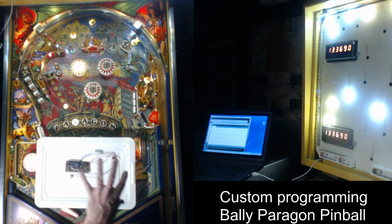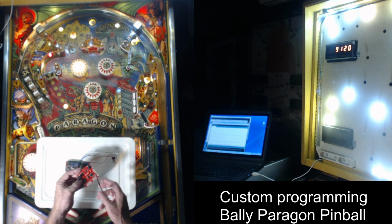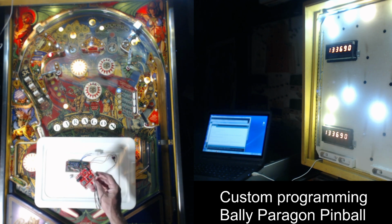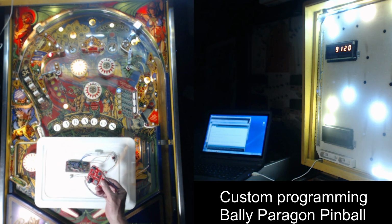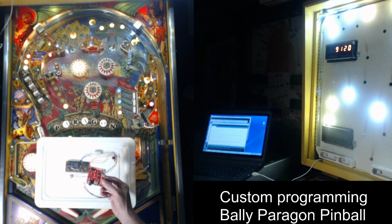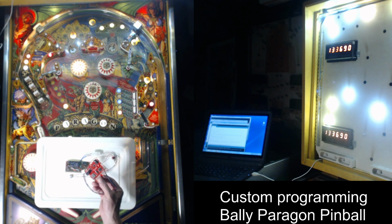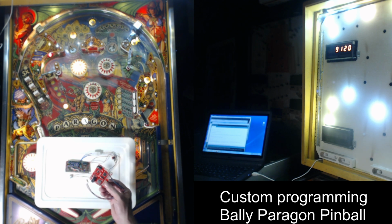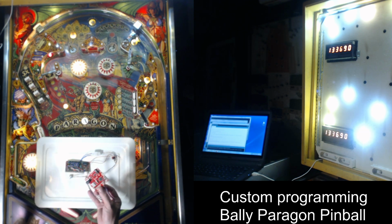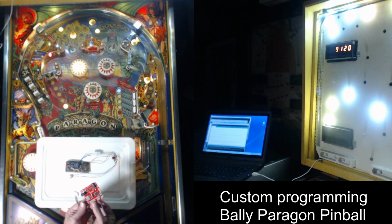It can control different soundboards and stuff like that, or you can use a completely new sound technology, such as this right here. This is called the Wave Trigger. This is available from SparkFun, and it is an independent audio board that has 14 voice polyphony on it, so it can play 14 tracks simultaneously, and it's CD quality sound. So this is as good as anything that you can get today in any pinball machine. So you couple this with a really good set of speakers, and you have as good a sound as, maybe even better sound than anything else that's commercially manufactured. So it's pretty darn cool.